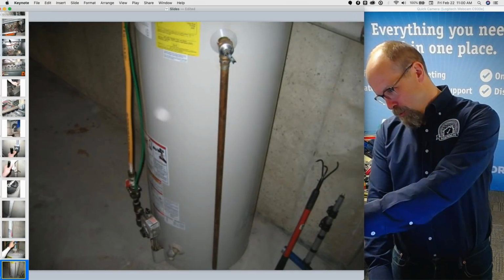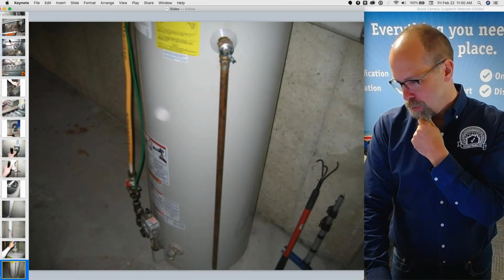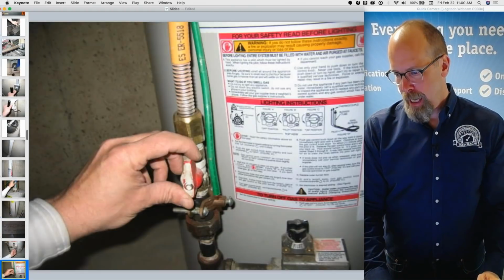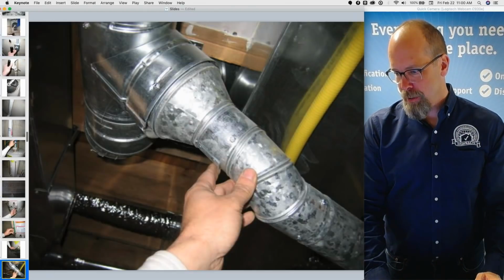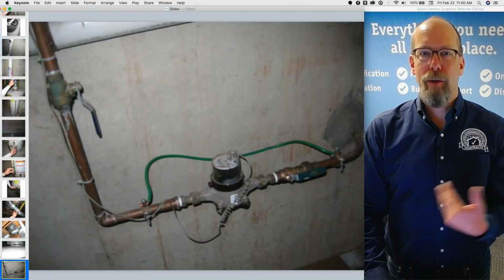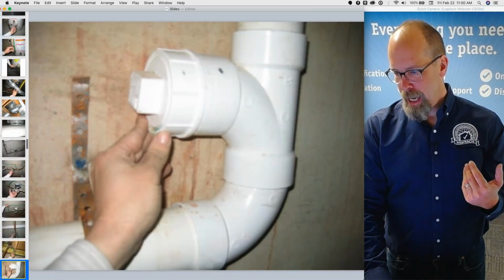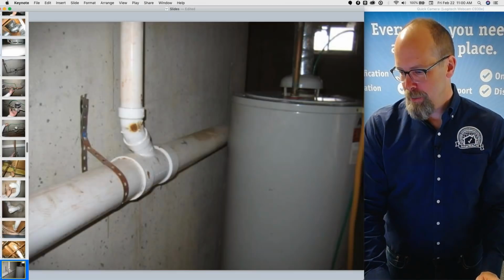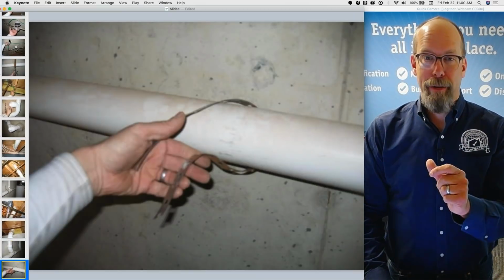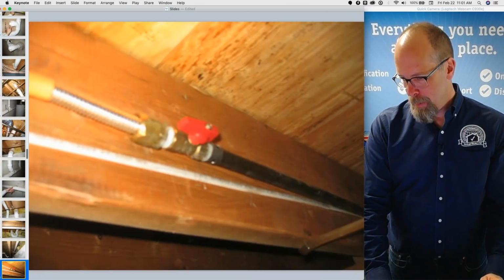And there's my tools from many years ago, the gardening tool and the moisture meter by the hot water tank. And you're required to inspect the hot water system. There's no problems here. Cold water coming in, public water supply coming in. There's the main meter and drain going out. Missing a strap for the drain waste pipe.